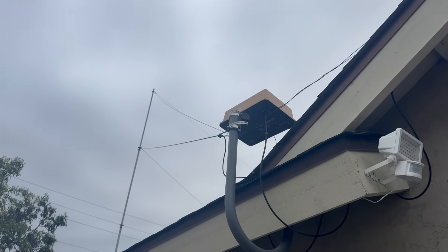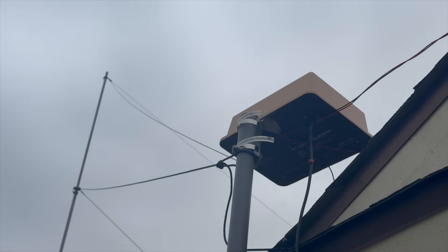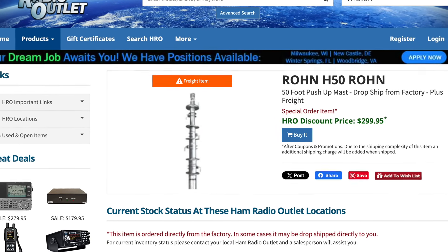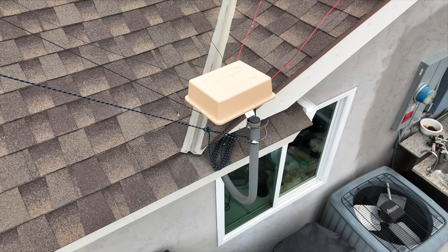The tuner I put up on my roof is a URT-1500 by Chameleon. Chameleon also has a URT-1, which I'll talk about in a bit. The reason I went with the URT-1500 is I can run a long wire right out of the base of the tuner with a radial wire spread underneath it, or I can attach a length of coax to another antenna. In my case, I took a long piece of wire — pretty much the longest I could — and ran it all the way up into a pulley at the top of a 50-foot Rohn push-up mast, then back down to my property. I have about 65 to 70 feet of wire going from the base of the tuner up to the top of the pulley and then back down — a bit of an inverted V, although a weird slanty cockeyed one. Underneath the tuner itself, I have about six radial wires that run about 14 feet apiece.